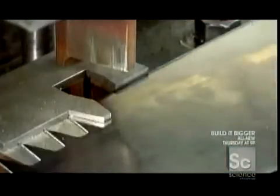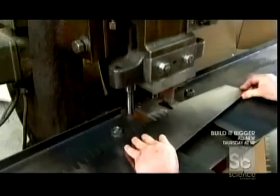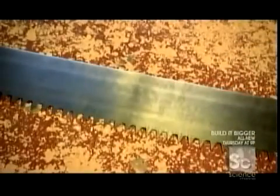A two-person crosscut saw is crescent-shaped and longer to cut through bigger trees. The teeth are also more substantial with deep pitches between them. Sawdust will be expelled through these deep pitches, so there's no need for gullets in this particular cutting edge.